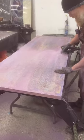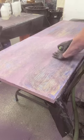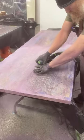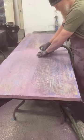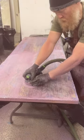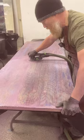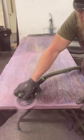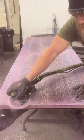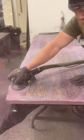That's going to be beautiful through there. Do most of your work with this first grit, so it might seem slow trying to get across this door. But make sure you're adequately cutting every area a few times so you don't have any little places that were missed. It's good to overlap a few different runs and keep your sander very flat the whole time, and keep steady pressure, steady back and forth movement. Let the sandpaper itself cut, so don't apply any extra pressure.